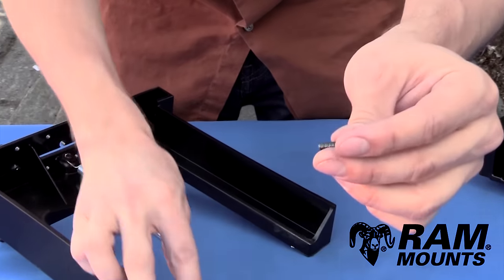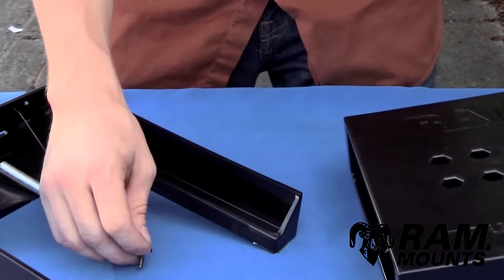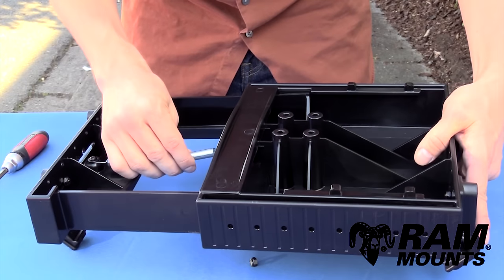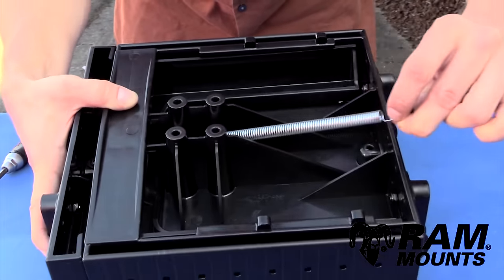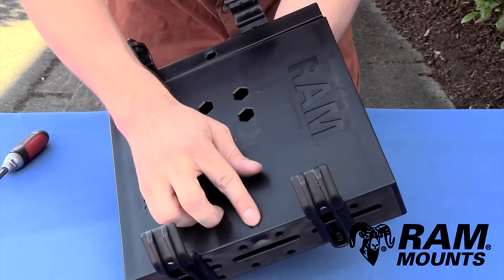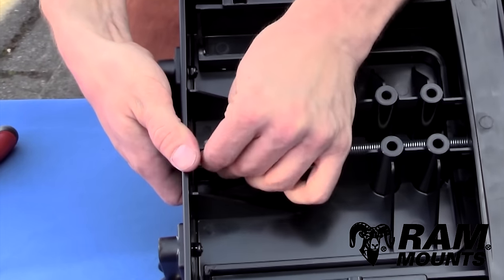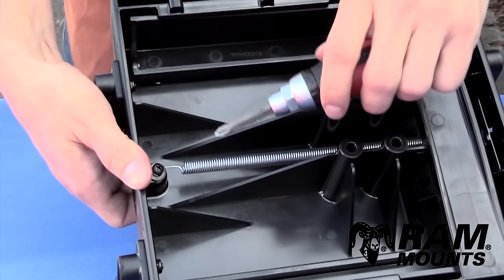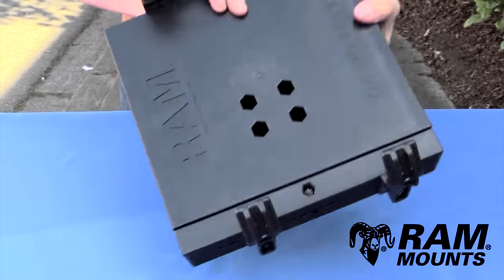Take the second screw, insert through the washer, then onto the opposite loop of the spring. Flip the housing and slide upside down, bring the spring inside, and while holding the screw and washer attached to the spring, pull the spring outward. Flip to the opposite nut pocket, drop the second number 8 nut inside, hold it down, then stretch the screw over and press it into the hole. The tension of the spring keeps it in place — then tighten with the nut held in place.